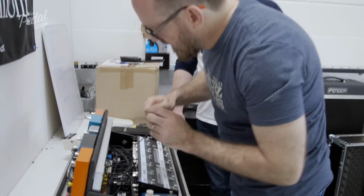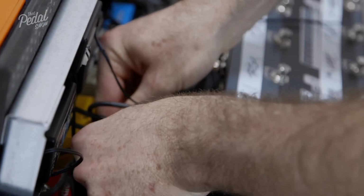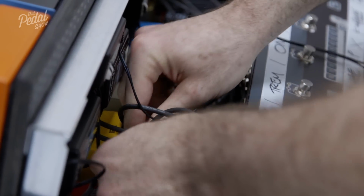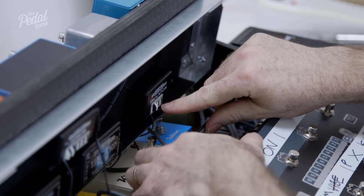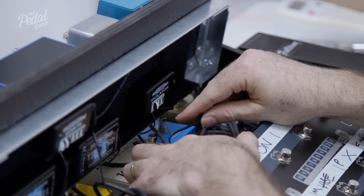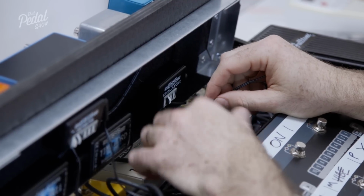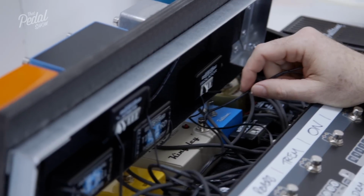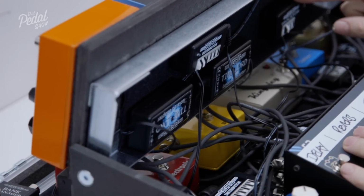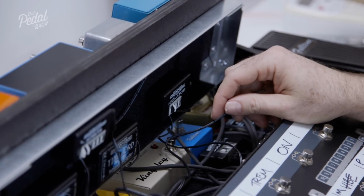Yeah, absolutely. I'm hooking the Humdinger here up to an isolator, which is one of the things connected to the distributor. This isolator has 4 9-volt isolated outputs, and it delivers about 140 milliamps of really clean isolated 9-volt current per output. So you wouldn't want to put a very current-hungry pedal on that.